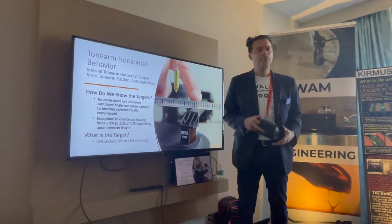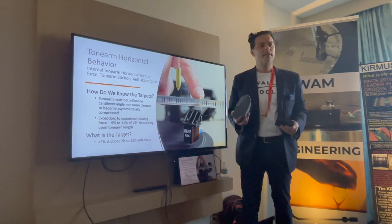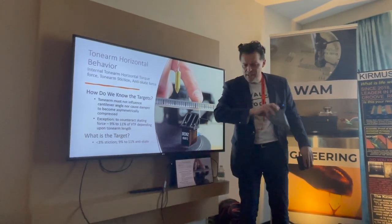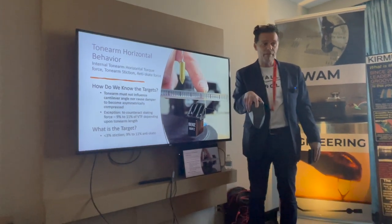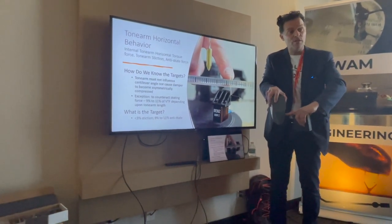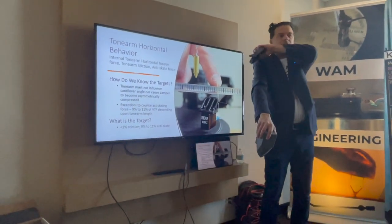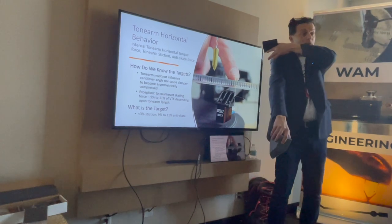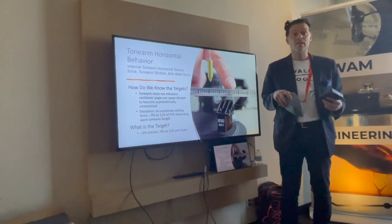So it's a similar thing to the skating force itself. But it's a mechanically generated thing, where the other one is just inertia. So skating force, when not compensated for, will cause the same issue. And since skating force is on average 10% of your VTF, if you've got a 2 gram vertical tracking force, that means 0.2 grams of skating force. Multiply that by 6, 1.2 grams of compression. That's 60% of your VTF applied to compress this damper heavily. No way that cartridge will function as well as it would have if you didn't have that force present.